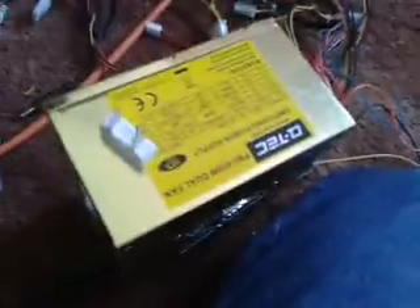This is my homemade flyback transformer. There's an IGBT on here and a pulse width modulation circuit. I've done a plasma speaker with this and it works really well, but I'm filming with my phone so I can't play any music through it when making a video. It's on at the moment running from this 500 watt — actually I think it's 450 watt — power supply. It arced over at first; it arced to the core, but luckily it didn't damage the windings, so I put some plastic underneath the coil form and that stopped it.